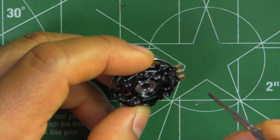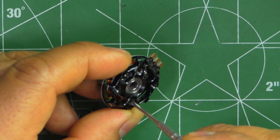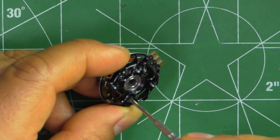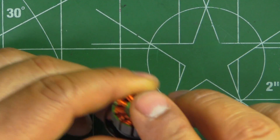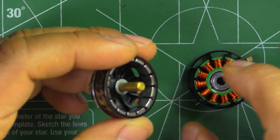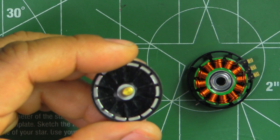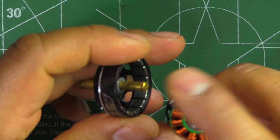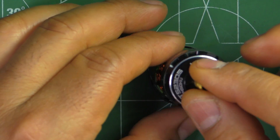It's probably a good idea to use some type of low-strength Loctite — the purple Loctite — so you don't end up cracking that PCB. Tolerances are also pretty tight. The shaft goes in pretty tight into the bearings — it's a four millimeter shaft. You really have to pull on it to get it out. So that's good — it's tight, it's not gonna have any wobbling there.